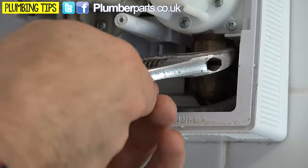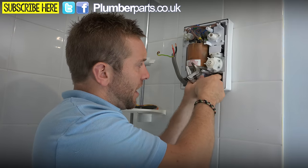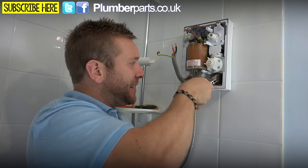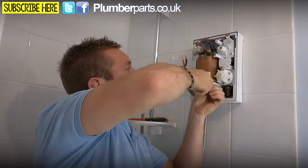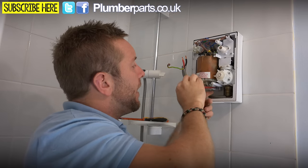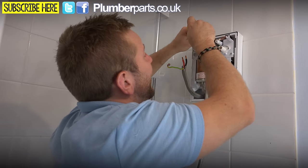Once we've got that slackened off, we won't be able to lift the shower off yet because we've got a couple of little screws at the back that we need to undo that hold the actual whole shower to the wall. Once we've got them off, basically we can lift the shower off the wall and start preparing our new shower to go on. So I've got them two loosened off now. I'm just going to get behind here and get these screws undone, and then we should find that we can take off a nice little shower unit. Oh, this is so exciting.